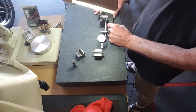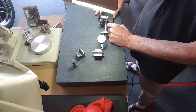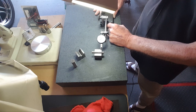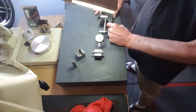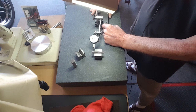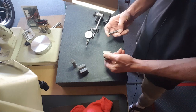I come over here and check it - that's way off, folks. That's more than half a thou, almost a thou off. It's crooked. The peak is two tenths under, so that's pretty bad. Let me make sure this side is still two tenths over - yep. For a precision block, that's pretty bad.